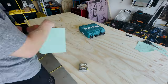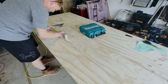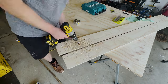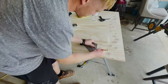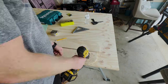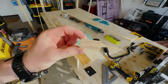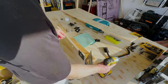This is where things get a little tricky — you just need to pay attention to the instructions. All the measurements are given, so just follow along and make sure your side rails are mirroring each other; don't create two rights or two lefts. The holes I'm drilling here are all the way through with a 1-inch Forstner bit — that's for the pivot of the bed. To prevent tear-out, drill on scrap wood or drill almost all the way through and flip it. Then at the foot end, drill a 5/8-inch hole half-inch deep for the legs to sit in.